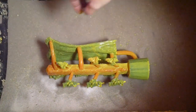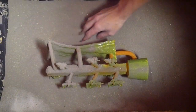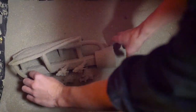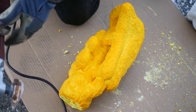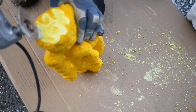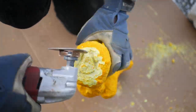Essentially, what this makes is a vessel in which the molten bronze can be poured into. This ceramic vessel is now imprinted with all of the wax and wood textures, which create a negative copy of the pattern. This ceramic texture will be what the bronze forms to, creating a final copy of the branch section in metal. Now that the wax is encased inside of a ceramic shell, it needs a hole cut in the top so that all of the wax can be melted and evacuated out.